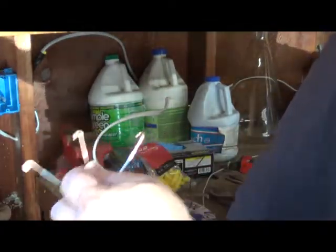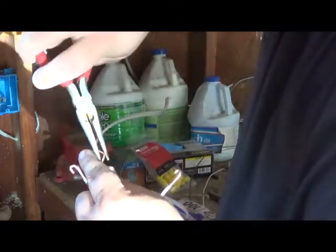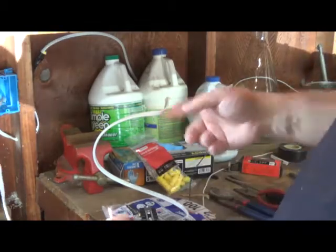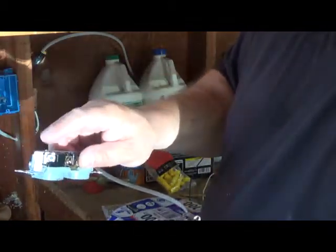In this one, because we're piggybacking it, the ground wire — which is the exposed copper wire — I'm not going to be bending that one. Because we're piggybacking it, we need to hook another wire to this with a third wire coming out to go to the ground, because both wires won't fit under that screw.